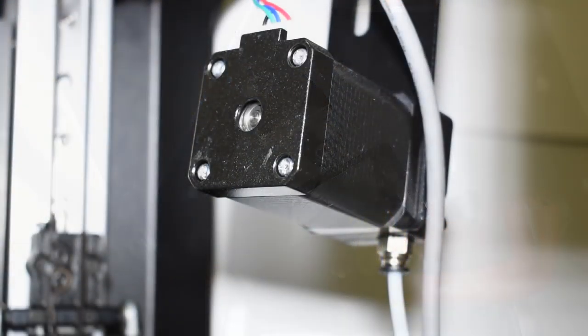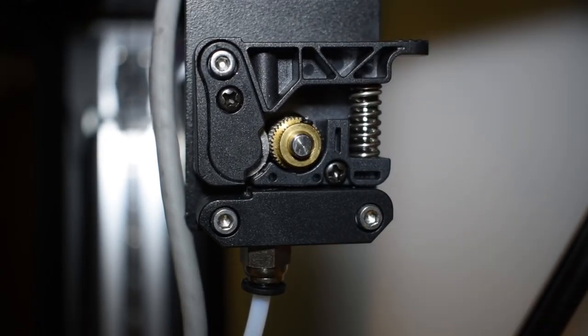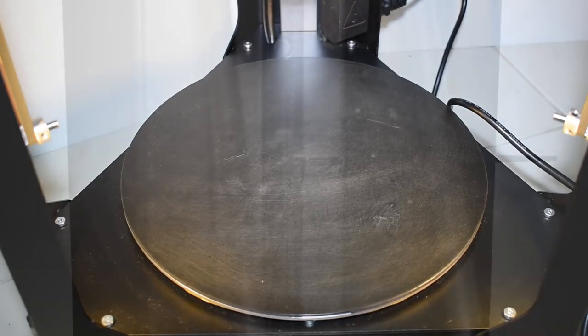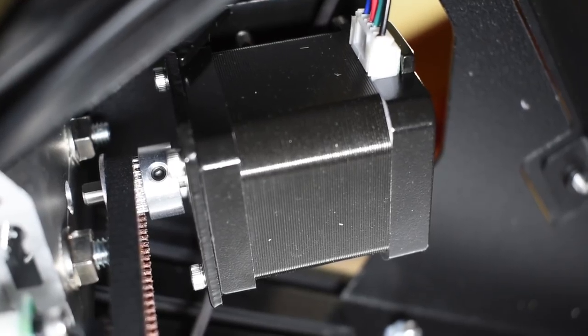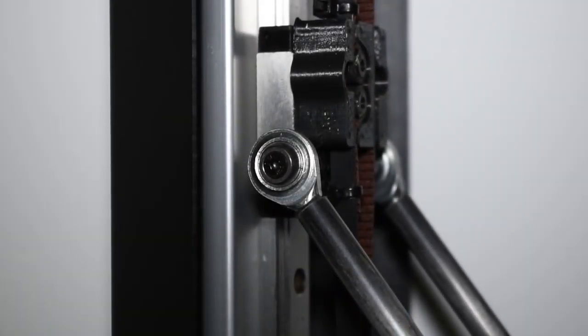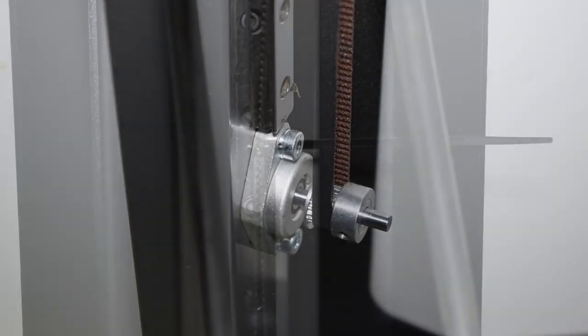This is something I want to check a bit deeper and talk about in the review video. The extruder motor is bigger than the axis ones. There is no reference if this extruder can handle flex filament, so that is something I will have to test. The print surface is something that I am very anxious to test — this is the flex build plate system from Triangle Lab. All three axes are equipped with linear rails and the end stops are all optic for better accuracy. None of the stepper motors have labels on them, so I don't know exactly what they are or their specs. The construction and materials used look very good. For transportation purposes, the belts are secured with zip ties.